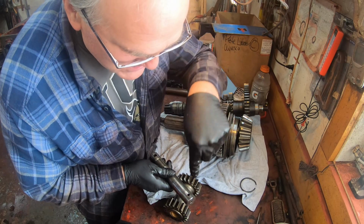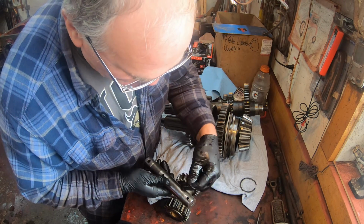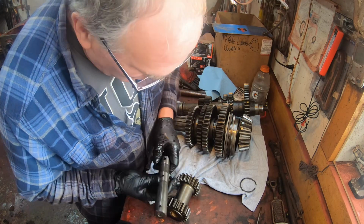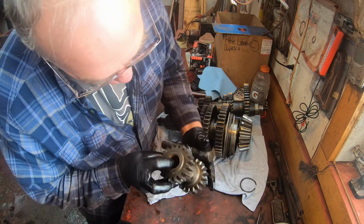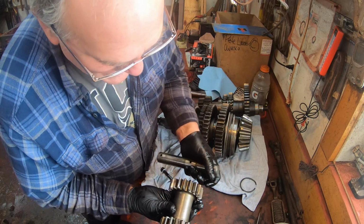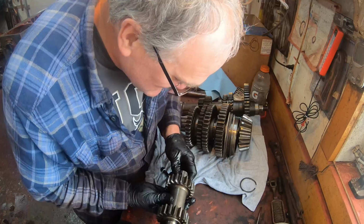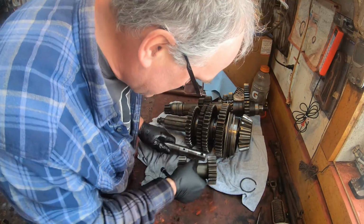When it sits in the transmission, the oil comes down and feeds it through these holes, and then it comes through that center hole and comes up in between the bushings in this shaft, and then the oil comes out both sides and feeds those bushings to keep them lubricated. Just amazes me how much thought they put into these things. My parts shipped today, so I should be putting that back together later this week.